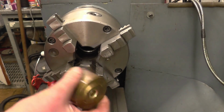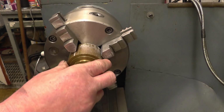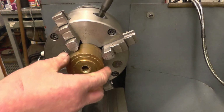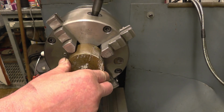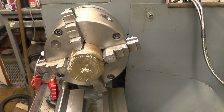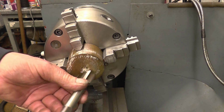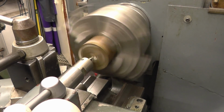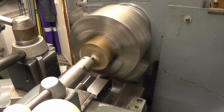I've got a bit of brass bar here and I need to put an M20 threaded hole through it. I have got an M20 tap, so I'll probably end up just putting a tap through it. Somebody's obviously trying to drill a hole in, the hole's off centre. So we'll start off using the back side of it and drill it from there. That's the M20 tap. It's quite a new one, so it should put the thread in no problem at all. It just appears to be ordinary brass, it's nothing special.